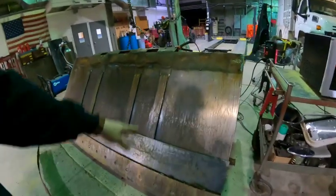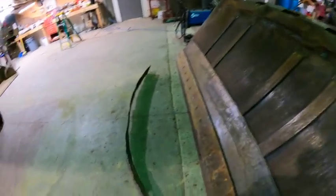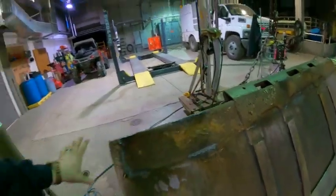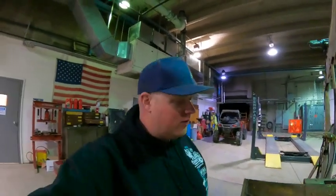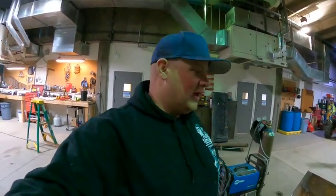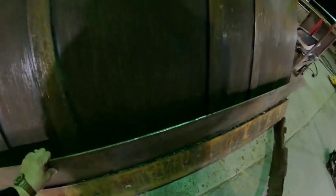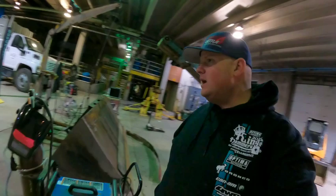I got this big snow bucket here. It's a crusty wear plate — lived along here and the wear plate wore out. So I spent today, well part of today, cutting it off with the plasma cutter set to arc gouge. I got the new wear plate here, and got a few repairs to make, a few things to tidy up on there. And that will be ready to go tomorrow.